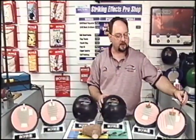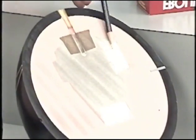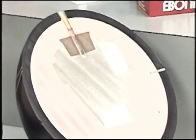To create our mass bias on the low torque core, we're using a 3.6 density puck, the same as the high torque. However, it is located 1/2 inch closer to the center of the core. This reduces mass bias.